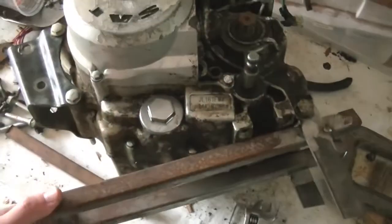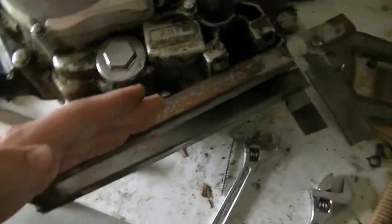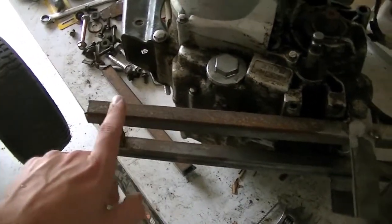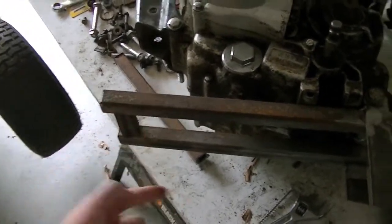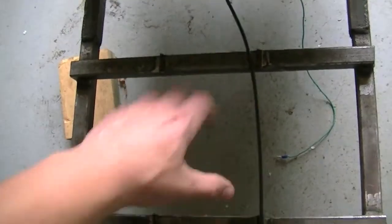So that's generally the scoop on this part. I'm going to get some more pieces put up and attempt to just drop it in place and see how it works. My plan is to add pieces of angled metal right here with oval-shaped holes in it for the sliding engine mount — probably one here, one on that side, and maybe a couple back here. That'll go straight down, and I'll drill holes in these two bars across, and that'll be your bolt hole with the sliding engine mount.